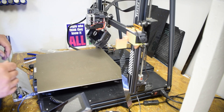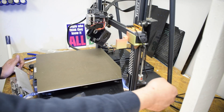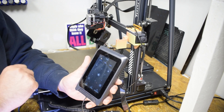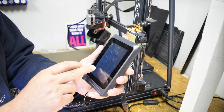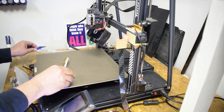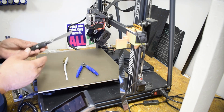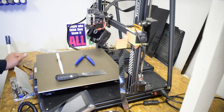That's also a good thing to do — keep spare parts, keep all the screws and stuff like that, because you never know, some of them are actually good. Let's press the on button and get some power to this. Go to Prepare, go to Temperature, and I'm just going to do — it's PLA — so I'm just going to start off at 180 and bring it up to temperature. What you're going to want to have on hand is a little brass brush, possibly some old side cutters — I would do old side cutters just because they're going to get messed up here and there. I have a little thin metal spatula. I'm not heating up the bed, by the way, it's just the nozzle. So we'll see what we can do.